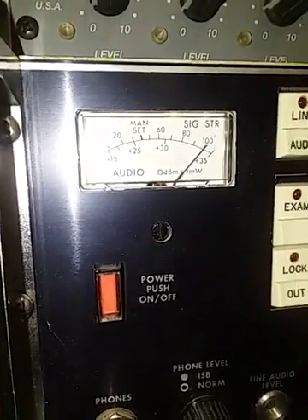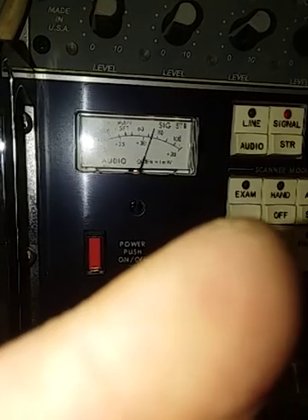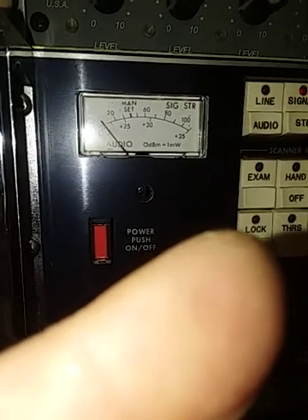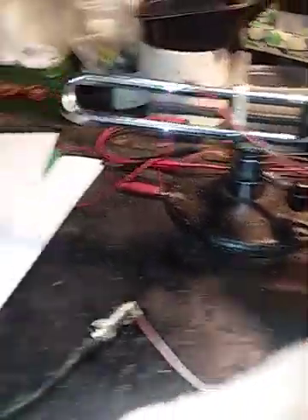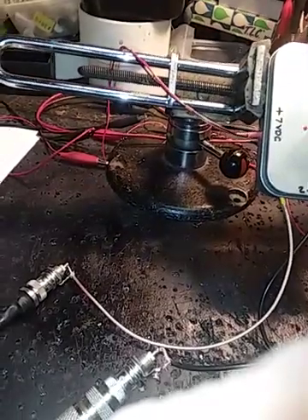We run past it — there we go. Now we'll do another one quickly. We go to the middle of the band and shut off the AGC. We're up near one meg — going up in frequency. I pinned it going over, then back down to zero and back down in frequency. That's the quick and dirty way of testing. It covers from about 480–490 kHz out to about 1.9 MHz — the entire broadcast band.